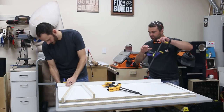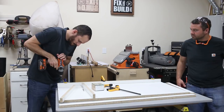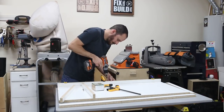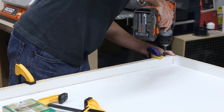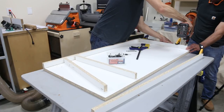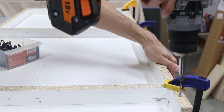With the dusty part done, we moved into the shop and started building the form. We clamped and screwed down one long side using a countersink bit and two-inch screws. We used the factory edges on the large sheet, which gives you a good 90-degree corner. To make sure the second long edge was parallel to the first, we used the divider and the other short end as a spacer, put that long edge against it, and screwed it in place.